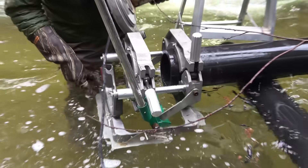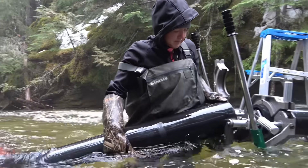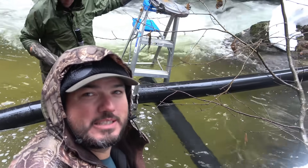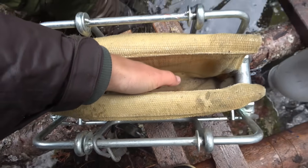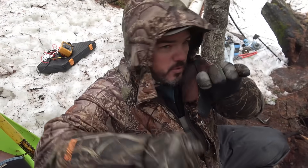This is a pretty crazy system. This jig is going to grind the pipe smooth on both sides and then melt it together. Look at that pipe — it's butter smooth. This is the magic heating wand and it's going to melt both sides of the pipe at the same time. Then we're going to whip it out and crush the pipe together — just like that.